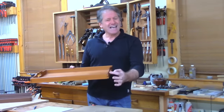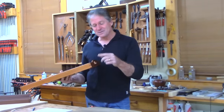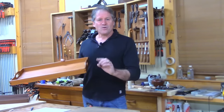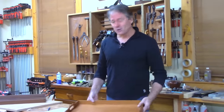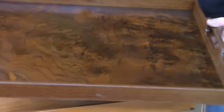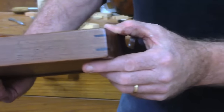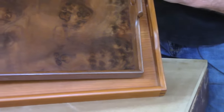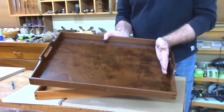I'll miter the corners and it's still going to be light. I asked the client if they'd mind if we put some splines in the corners — that's the main thing I want to talk about today. I suggested ebony splines into a walnut serving tray that was mitered. So let me show you: you can see that burl walnut bottom — I love that color — and you can see the mitered corners with the ebony splines. Notice how the top edge is only 5/16, so it presents more elegance.